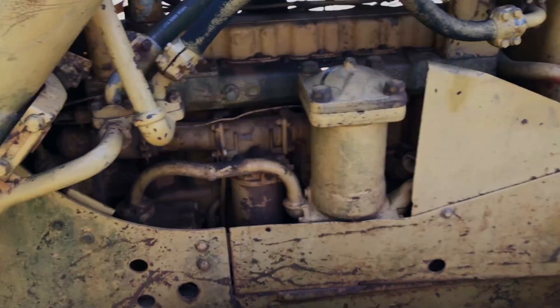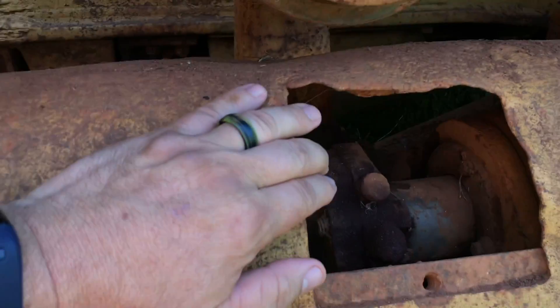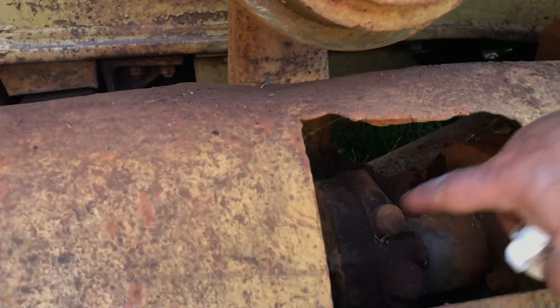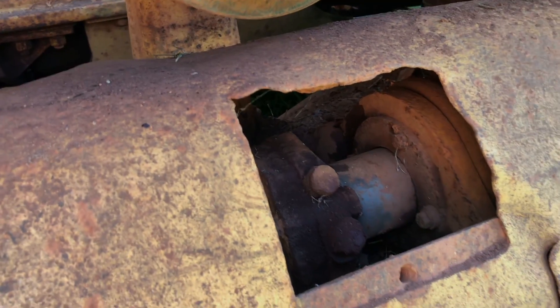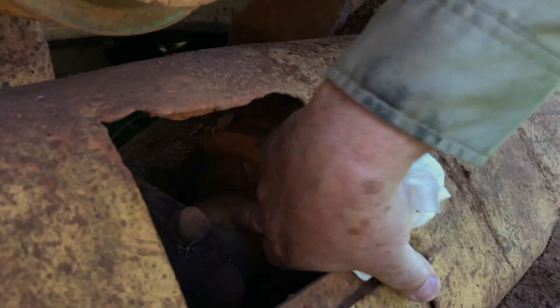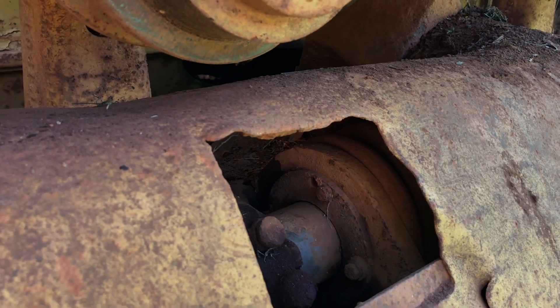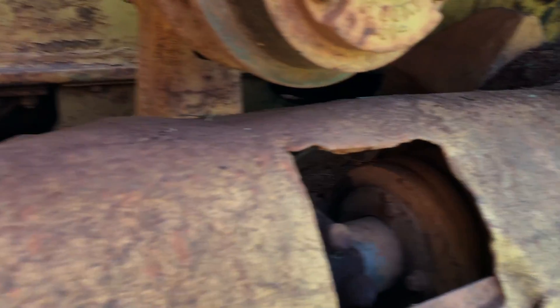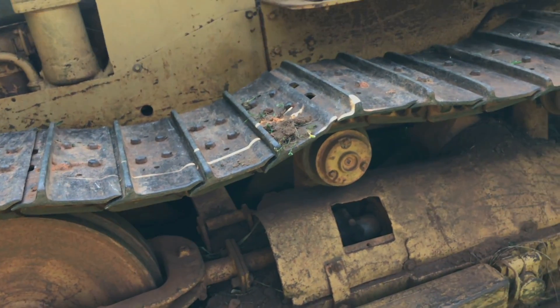Right here's your track adjuster for this side, and it needs a tad of grease in it now. Track adjuster — you screw one of these running off, and there's a grease fitting under it. Just pump it up and it pushes this piston out right here. The other side is fixed — somebody shimmed it. This one went to the bad and I fixed it.